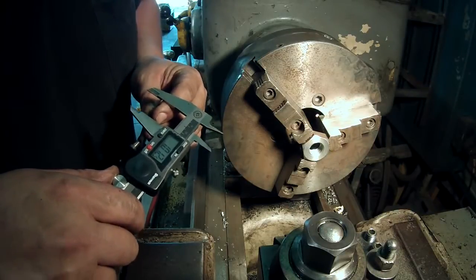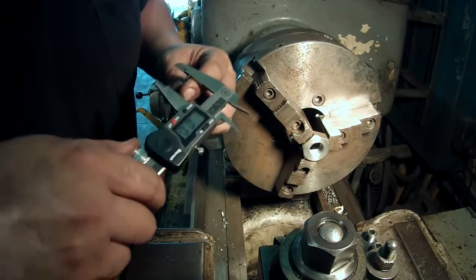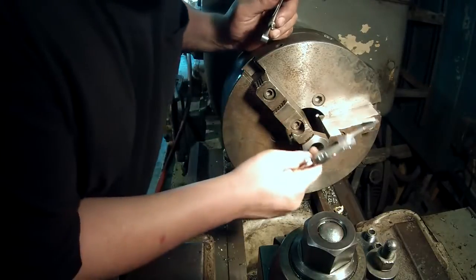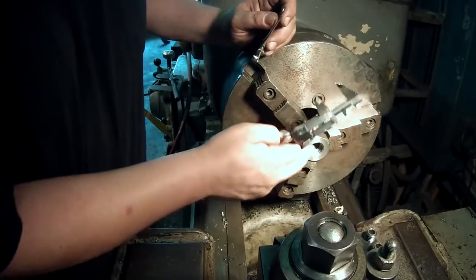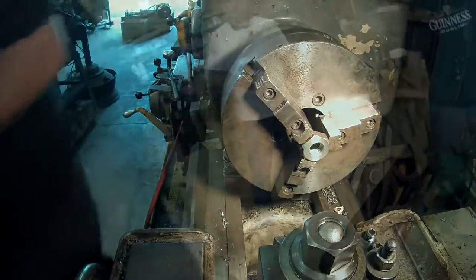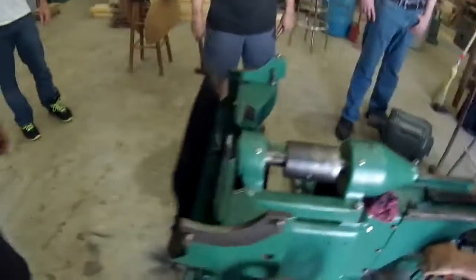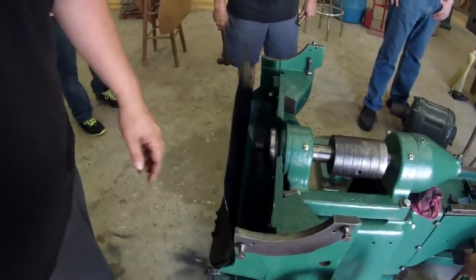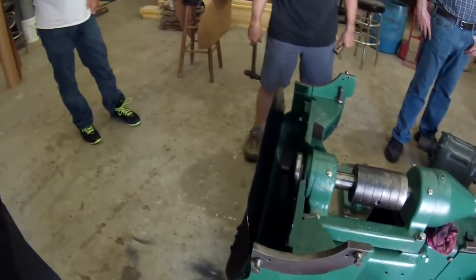Okay. I'm getting about 1 inch 10 thousandths, so we may be there. I'll probably make one little spring pass and then take her out, check it. No, just hold it and show. Okay, how do you see what you're looking at? You can't. That's fine. I'll just hold it. That's the thing about the GoPro. You just point and that's it. All right, there you go.